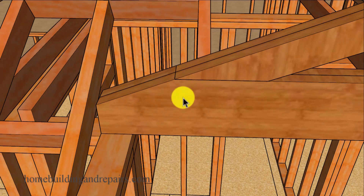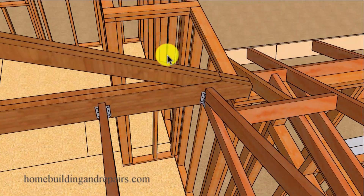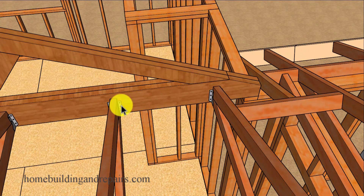On this side I went ahead and provided you with a design of something you're probably going to end up with, though I have seen it done both ways. We are going to use hangers almost all of the time to connect the existing roof trusses to the new girder truss. The most common reason for using a girder truss like this would be to create a flat ceiling from the existing house to the new home addition.